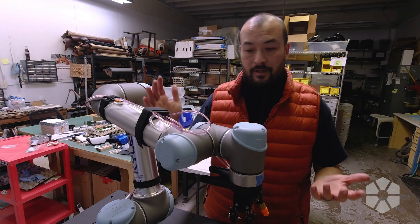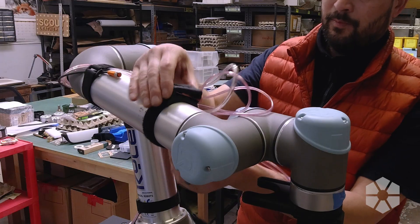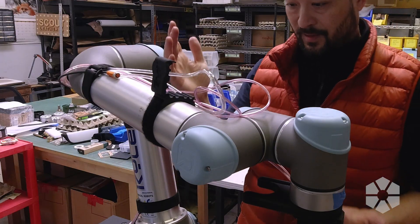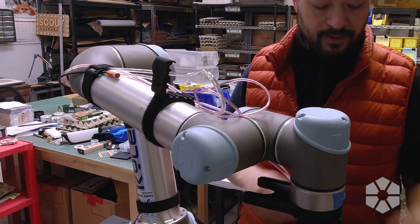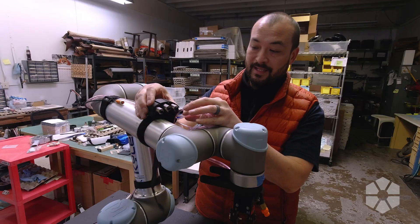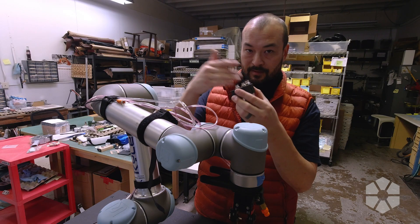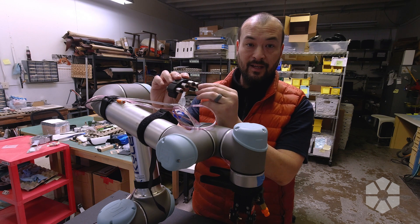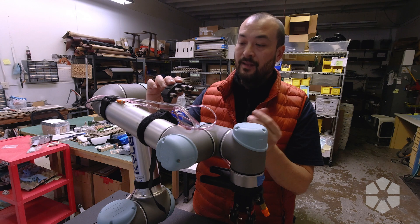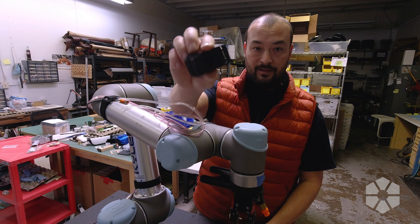Let's go try to fit this up on the robot and see if I have to start over or not. So this is generally my current setup — this is a 3D printed thing from EMI, it works great but it does not allow quick disconnect. So basically here's the manifold we're going to replace this. All the incoming air, as far as the manifold goes, is going to get plumbed into here, but when I remove a tube on the output side that valve is actually going to close.